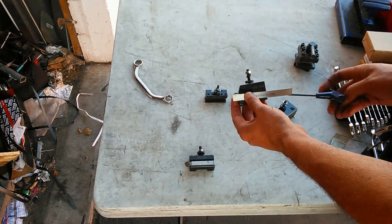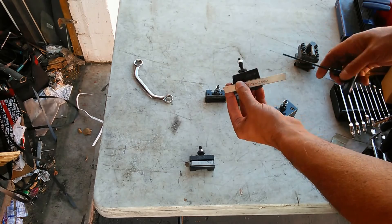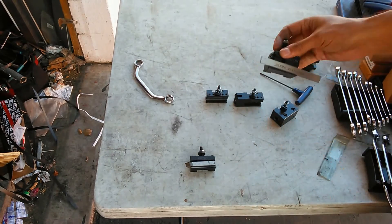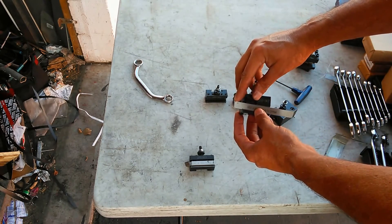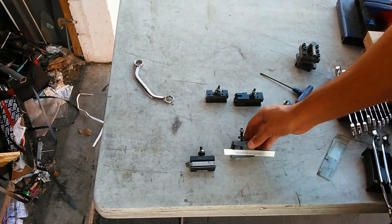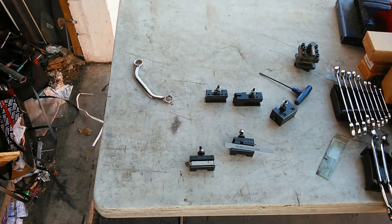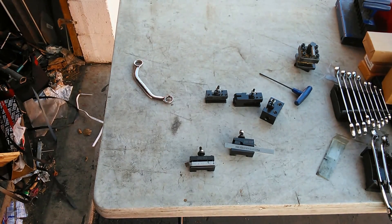This is a parting tool, so I'm going to slide it out a little more so it can reach the center of the stock. I cut up to about three-eighths-inch stock, so I need to make sure it can cut all the way to center. Now that's locked in. I'll need to set the height adjustment just like the other tools — turn the wheel, lock the nut, so the tip reaches exactly the center of the workpiece. That's it — that's the new quick-change tool post. Hopefully you learned something about how these tools work and their setup. Thanks for watching.